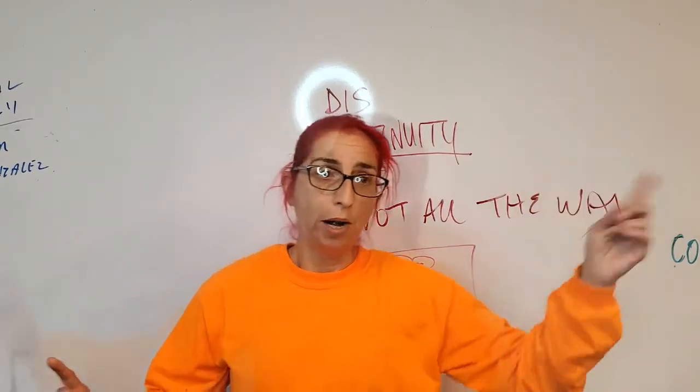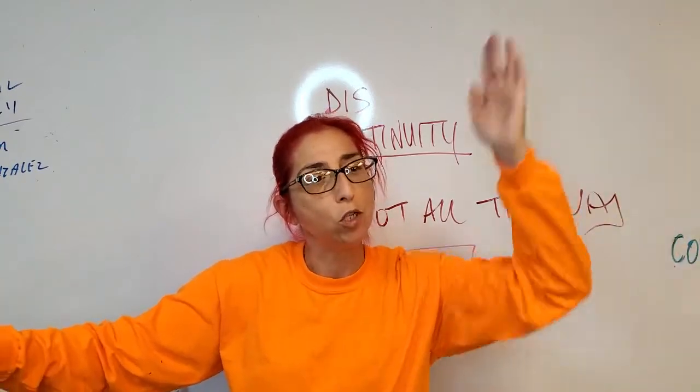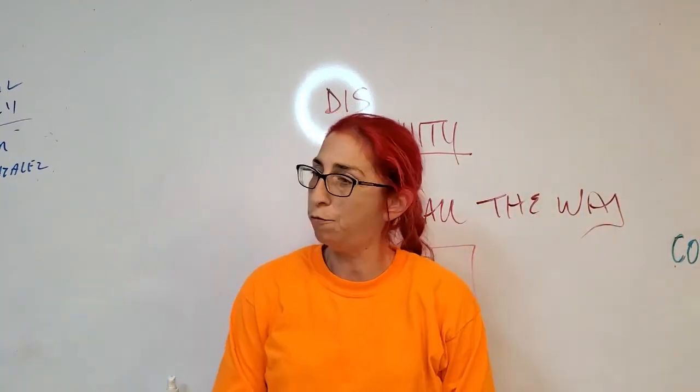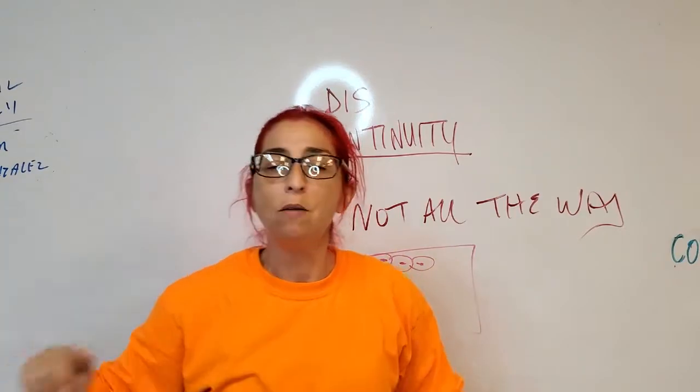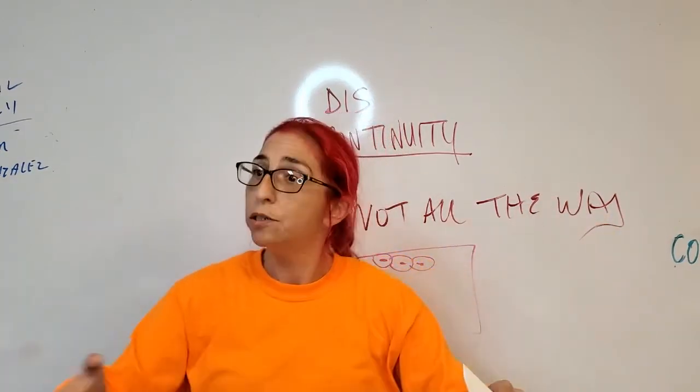One end is too cold, right? One end could be too hot. This is also when we use a runoff plate. This means starting all the way on this end of the runoff plate and ending over here because I have good weld here and I know I will. So there's less issue for discontinuity in that area.